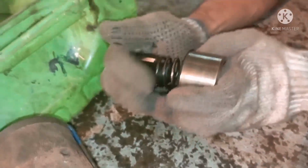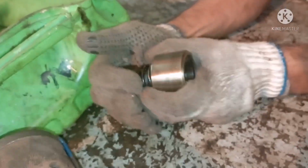Next, for the valve body, you have to check the mating surface. As I said earlier, all mating surfaces should be free of any kind of damage, pitting marks, scoring marks, cracks or anything like that. It is basically a visual inspection, nothing much. That's all. So I kept all the three.